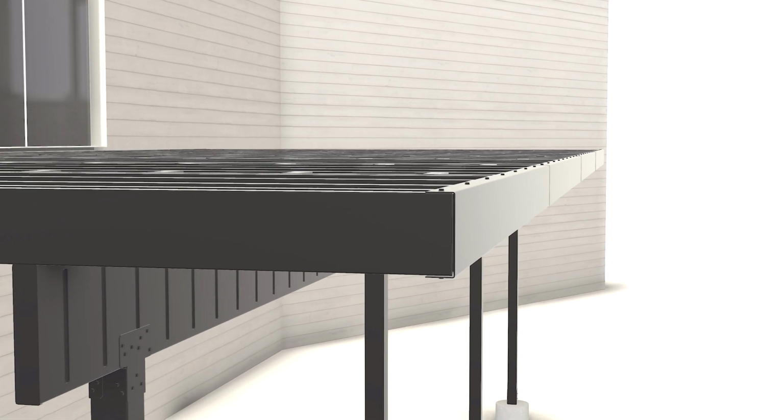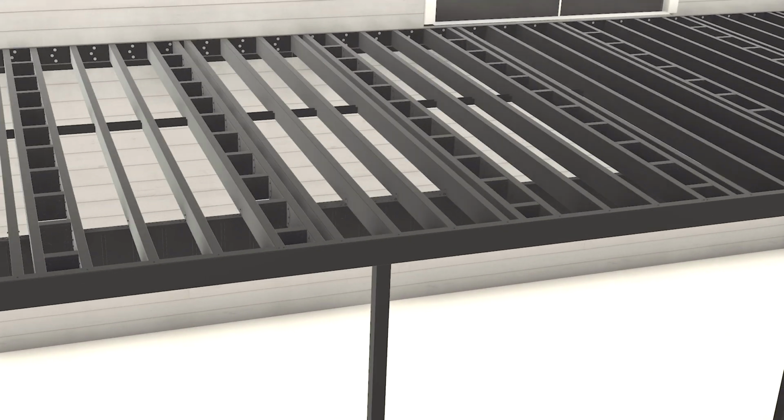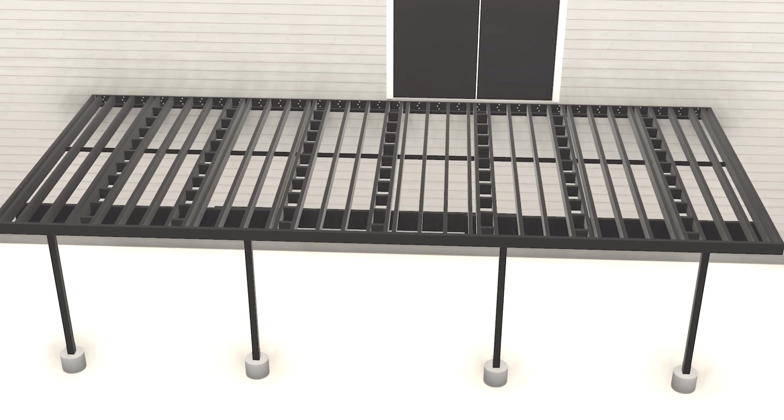The blank U rim joist can be used to cap joists on the end of a drop beam deck in situations where non-standard spacing of the span joists is common throughout the deck. This can occur fairly often as many decks will have breaker boards and patterns to them.